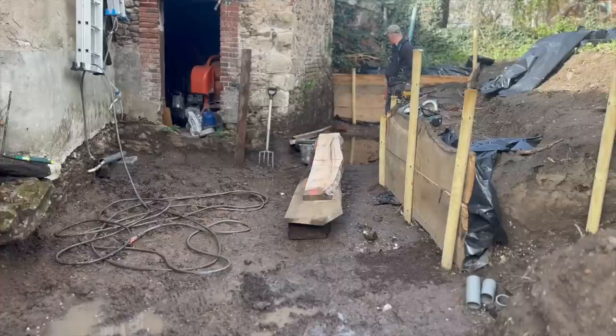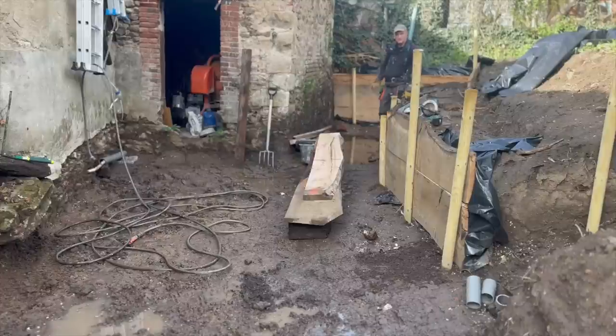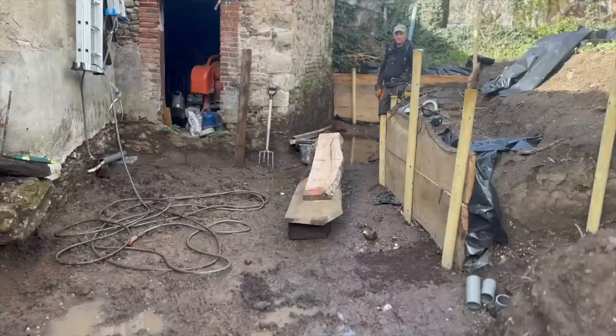It's gonna be from all the way in the back here, all the way forward. But I might have some side drains to it as well. Why? Because I probably have enough pipe for that, and might as well put it in. There's no downside to having it, really, provided that it's on the right angle, the right slope, so that it drains properly.